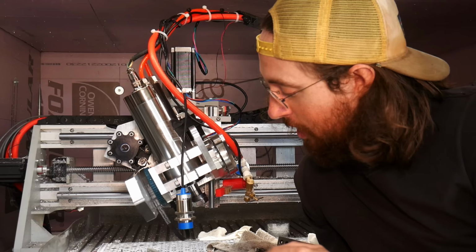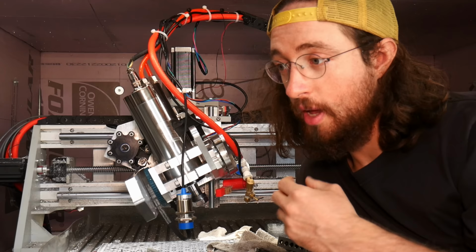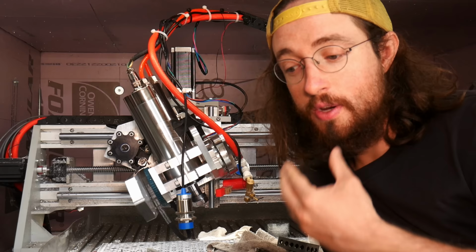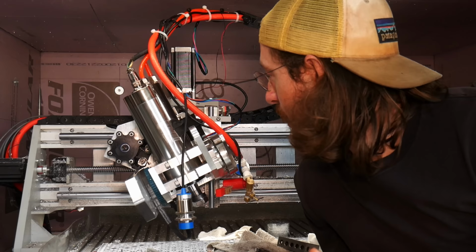And while I think that actually was true from the standpoint of the stiffness of the belt, and also my gear ratio, I think my gear ratio actually had enough torque. I ran all the numbers once I realized there was a problem, and I think it probably would have worked. The problem is there's actually play inside of motors, which I didn't know until this project. I'd heard one video talk about it, and I thought, it won't be a problem. And it turned out to be a giant problem. That play in those motors ended up causing this machine to not cut accurately.